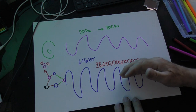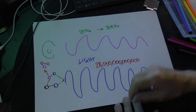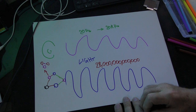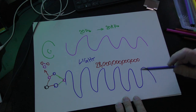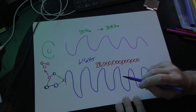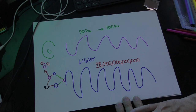When we fire a laser beam at wood, we produce smoke, fumes, carbon dioxide, carbon monoxide, and eventually the carbon disappears into a gas. Well, that's nearly enough material science to get you through what we're trying to achieve. The critical point about this is light affects molecules. It can't drill into the centre of a piece of material and damage it.